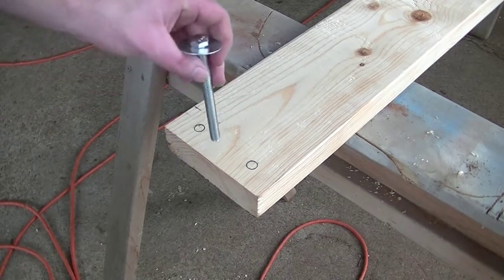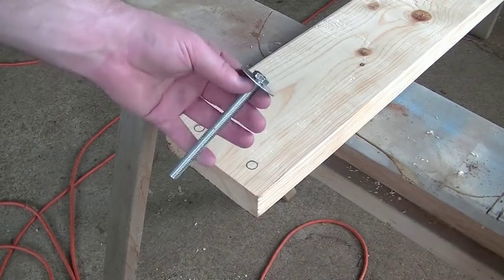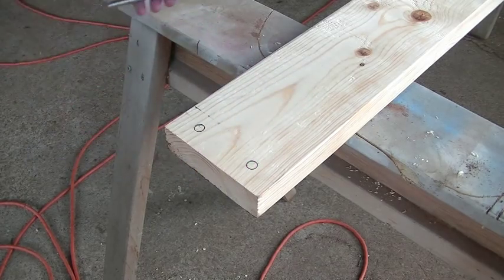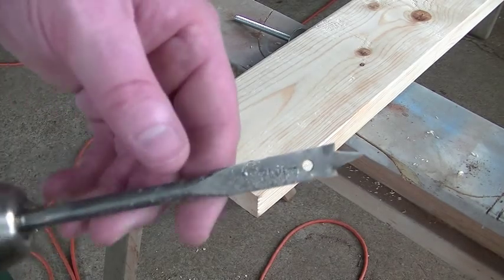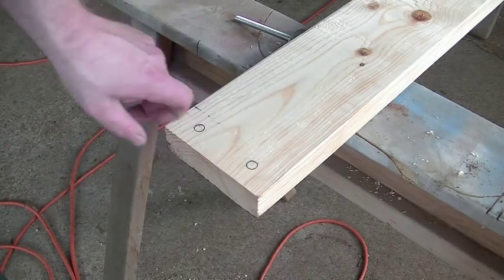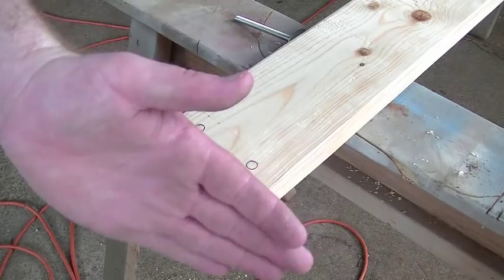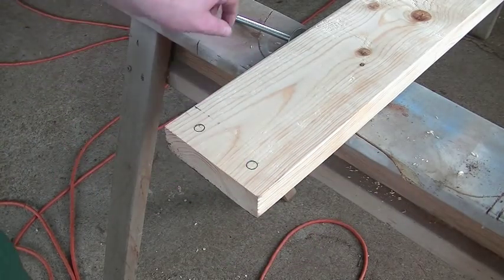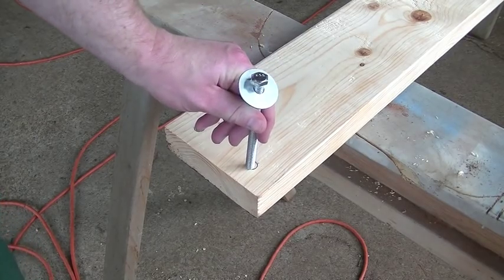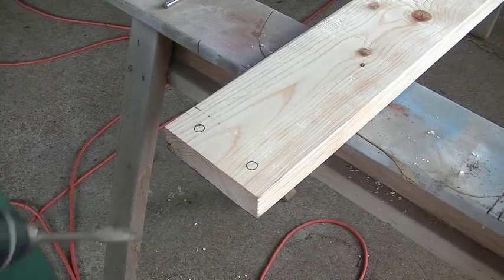I did get hardware. Earlier in the video, I was saying I wasn't sure if I was gonna get 5/16 or 3/8. Well, I did get 3/8 inch hardware. And if you remember, I drilled the holes in the metal cradle half inch. And like I just showed you, I'm gonna be drilling these at half inch as well, just for clearance, because when we get the cradles hanging from their pulleys, they kind of want to sway and move back and forth. Having some clearance in our holes just makes it a little easier to get our bolts in place. So we'll drill this out, then we'll mount these up.